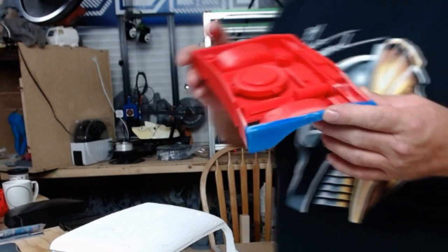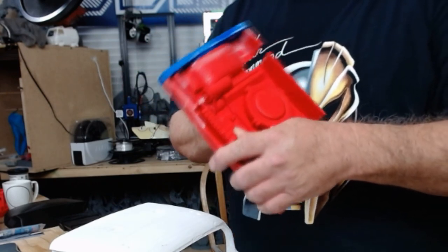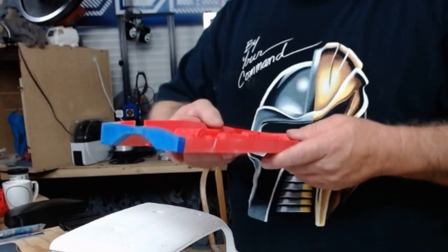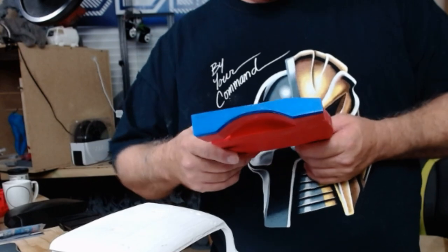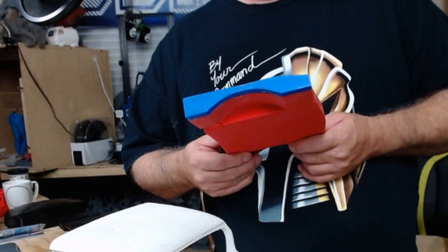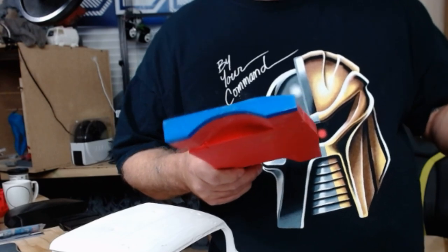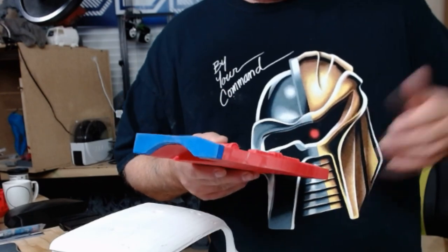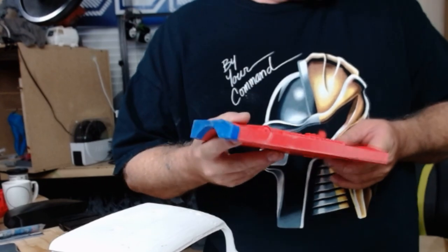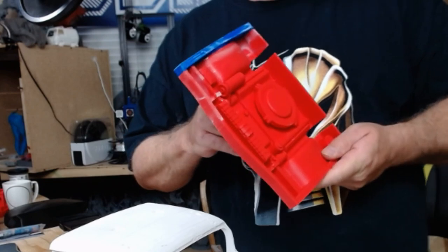Here's that compartment for the engine — you can see right there where I ran out of PLA, and that really sucked, but it happens. I don't have a filament run-out sensor on my Ender 3 V2 yet. I'm waiting on TH3D Studios to come out with one, but Creality had multiple boards they put in this printer and they're trying to work the bugs out of the firmware so I can get a filament run-out sensor and a BL Touch on it.